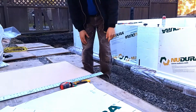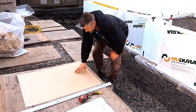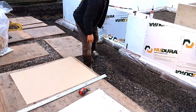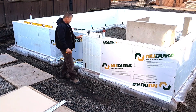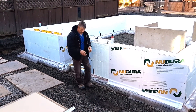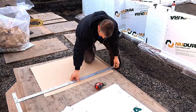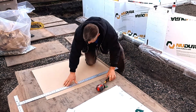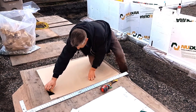We pre-cut our pieces, and on the back of the peel-and-stick I'll use the back edge of a knife. If I'm cutting this particular piece and I want a three-inch overlap — they have the overlap marks on here already — I'll take the back edge of a knife, score the back of the paper just like that. Corners can be a little tricky, so scoring the backing paper is the key technique here.